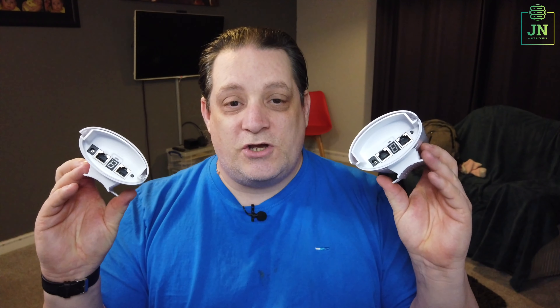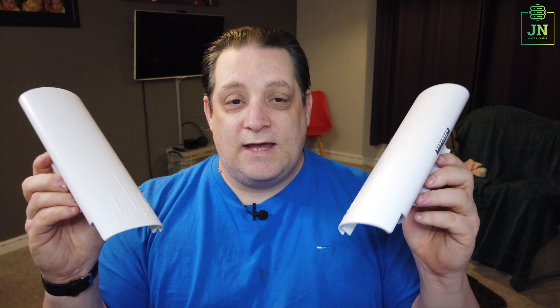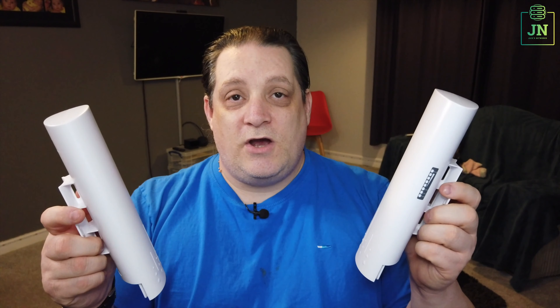So these are the two boxes in question. They are wireless bridges, so don't treat them as wireless access points, because they're not. They're for joining two buildings together — two offices, whether it's a house or a man-cave shed at the bottom of the garden. It's standard 5.8 GHz with a maximum three-kilometre range. It has to be line of sight, so you can't have things between them because it'll cause connection issues and slow things down.